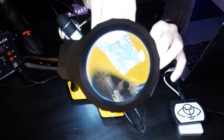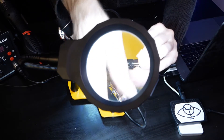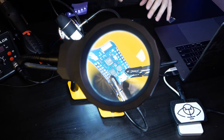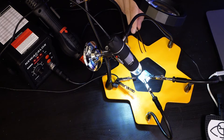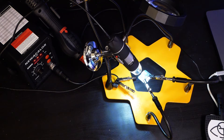Take your board and place it in a pair of helping hands or a rework station. I got this one off Amazon — it's pretty cheap, but it does the job of holding onto the board while I'm working on it. And this is a great way to make sure that you are able to see everything that you need to do. If you can't see this all with an actual magnifying glass, then you can take the next step and pick up a cheap little microscope as well. To pull this off, we're going to use a hot air gun to heat up the board and get everything a little bit warmer before applying a gentle amount of heat exactly to the part that we need to move, and then taking tweezers and this microscope to very carefully remove the component and move it slightly to the side. The microscope is basically seen as a webcam by the camera, so you should be able to follow along and see what we're doing even though this is incredibly small. So let's give it a go and try to move the resistor over just a little bit so that we can get access to this awesome external antenna port.